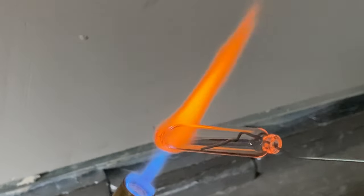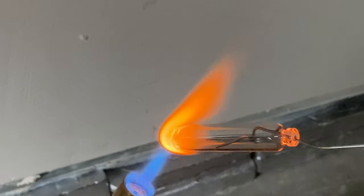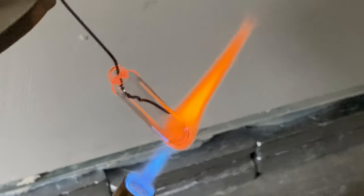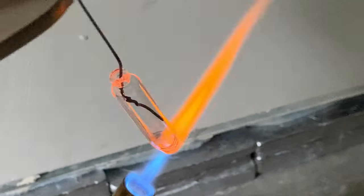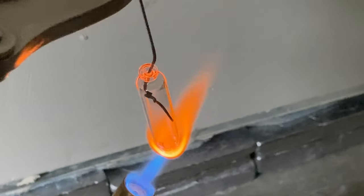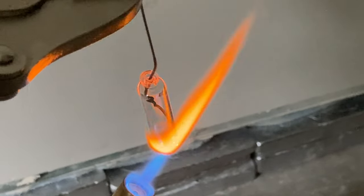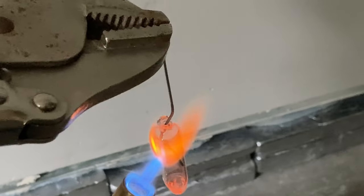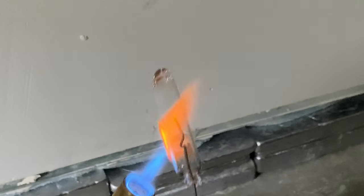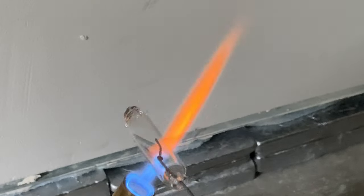The original fiber optics weren't made of plastic polymer — they were made of thin spun glass fibers, and today some fibers are glass inside plastic, which have the best optical performance. Boron is added to glass because the boron atoms get between the sodium and the silicon, and when it cools it strengthens by pre-tensioning everything so you don't get irregular tension in the glass — which is why normal glass has to go into an annealing furnace to relieve tension. I'll keep the part moving back and forth when I'm closer to finishing, keeping the whole thing warm to minimize the probability of the piece cracking while cooling.